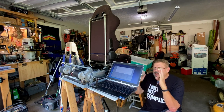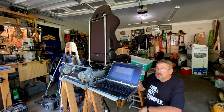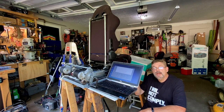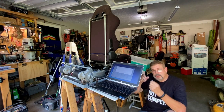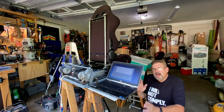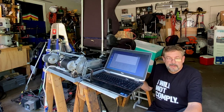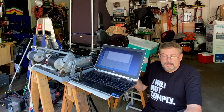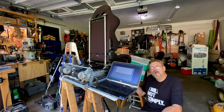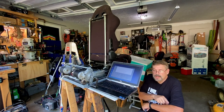If that happens to you — you fire up your first motor and you get just a little bit of movement, then when you try to move the potentiometer to center it goes the other direction, or you turn it on and it just starts spinning — you've got to flip the motor wires. This is NOT the 24 volt wires going to the IBTs from the power supplies — those need to stay positive and negative. It's the motor wires, the M wires, that you flip. Just unscrew them and switch them, make sure everything is off, start it back up and once you solve that little problem you're going to be happy.